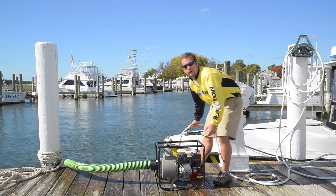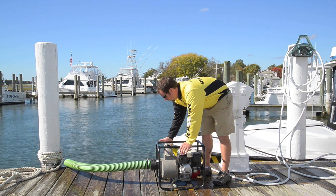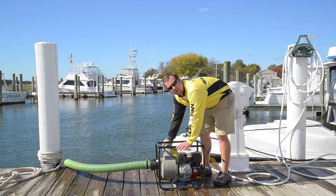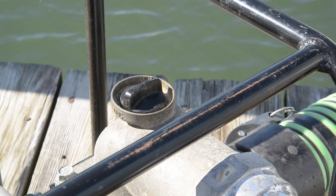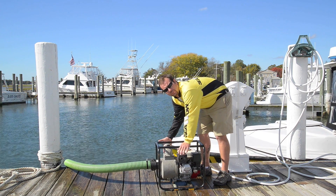If you don't have a garden hose, you can try — once your suction end is in the water — just putting your hand over it for a minute to see if that works. If it doesn't and you need to get water in, you can pop off this top piece and dump as much water as you can from a bucket or a soda bottle, then re-tighten it and see if you can get a prime that way.